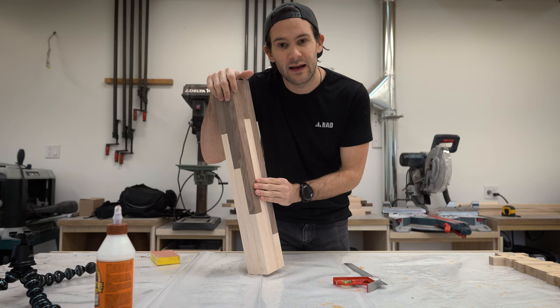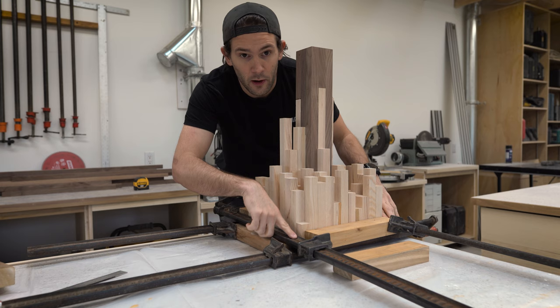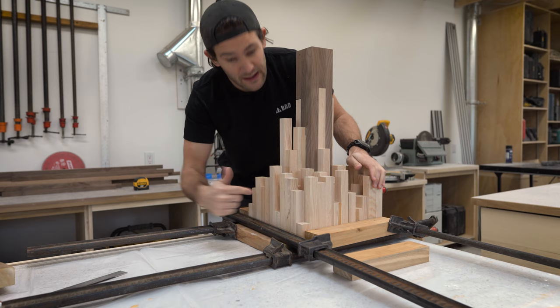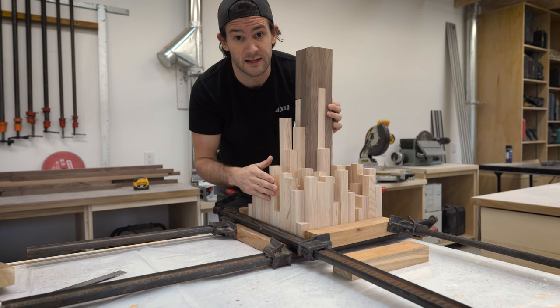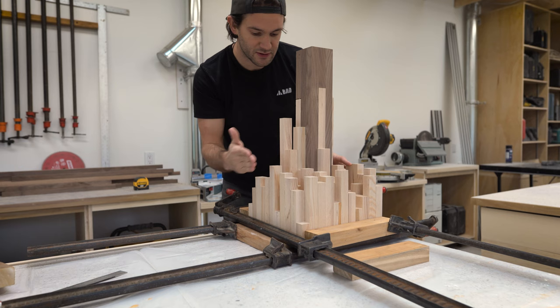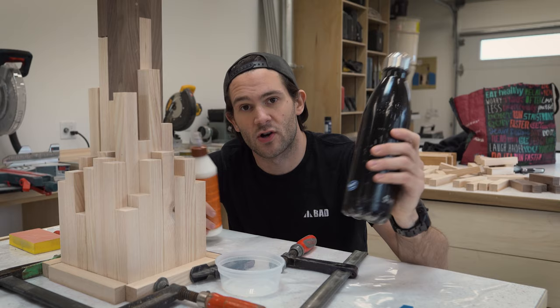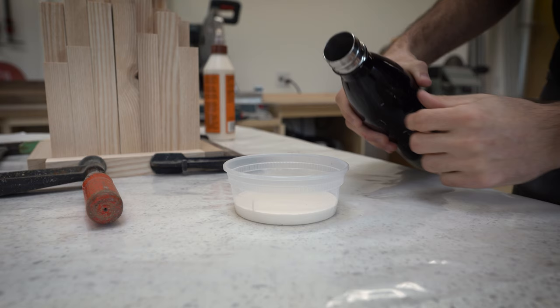The central column is now done and I get to move on to the next phase — figuring out how to make the bottom and the top. I have four bar clamps clamped to some sacrificial boards keeping everything compressed together, and it's all pretty solid. I think doing the full thing in one glue-up is a bit too much to manage in 30 minutes, so I'm going to do half at a time — the inner two rows first, then the outer two rows. To give myself a little more working time, I'm going to add a little bit of water to my glue to extend the drying time.